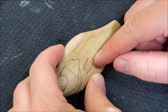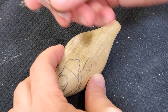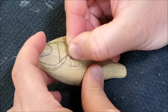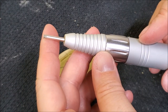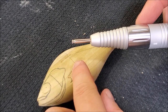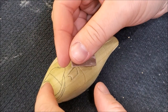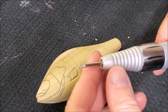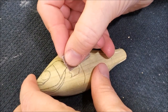There are one of two ways that you can go about smoothing out some of these carvings. One is to fold up a piece of sandpaper and get in there and sand it out, and the other is with a rotary tool. I'm going to kind of do a hybrid — I'm going to use a rotary tool to get in there and smooth the bulk of the work, and then I'll follow up with some fine sandpaper to finish it off. The main reason I'm going with the rotary tool is that it's faster, but if you don't have one you can get this done with sandpaper.